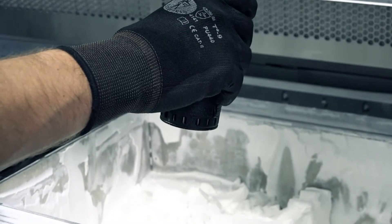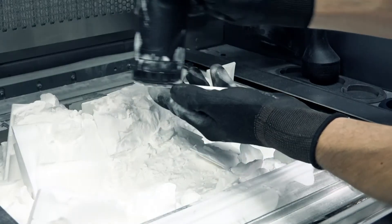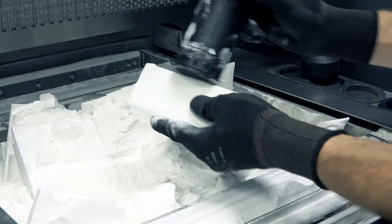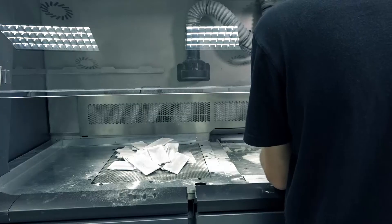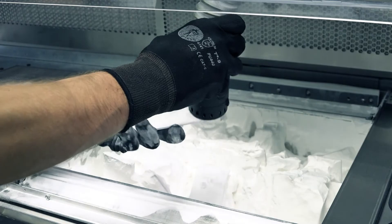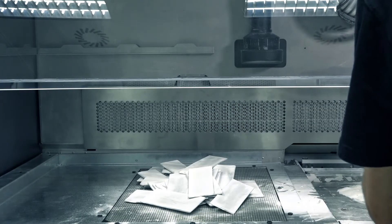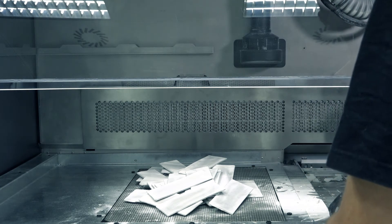Grab the reusable material collector. Lift the build unit platform by pressing the button until the vacuum reaches the area you want to clean. Clean each part separately to avoid having clumps of material covering the part. You do not need to clean every surface thoroughly, because the material closest to the part may reduce the overall quality of reused material. The excess material is removed during sandblasting and post-processing. A part that is free of clumps and major debris with some remaining material is ready for bead blasting.